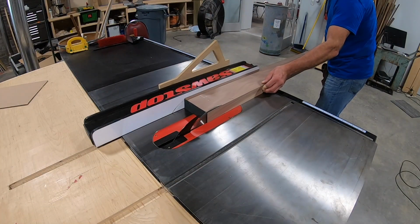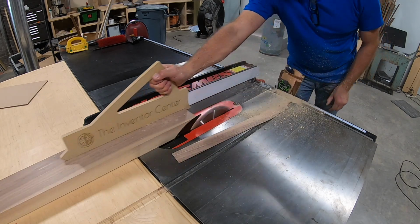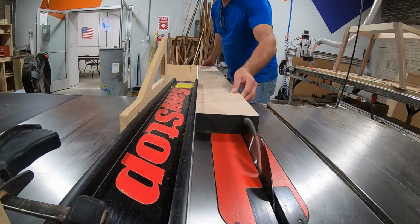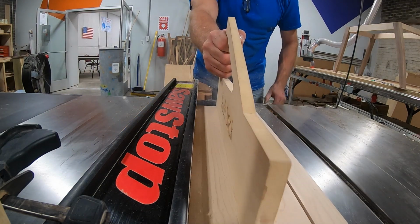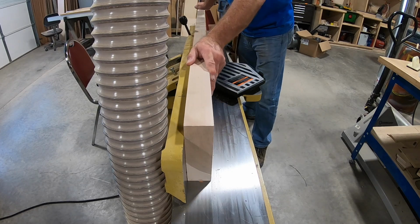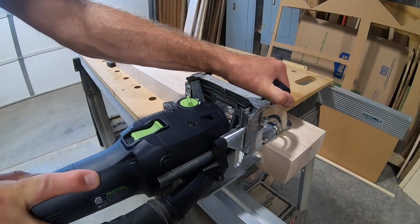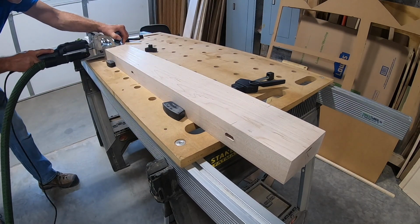Once the frame assembly was complete, I start building the top. As you saw in the frame, I like contrast, and maple and walnut contrast really nice against each other, so I wanted to incorporate that into the top. I wanted a really tight glue up that wouldn't show any seams, so I jointed the parts one last time before cutting the dominoes. The dominoes might add a little bit of strength, but they're mostly for alignment during the glue up.